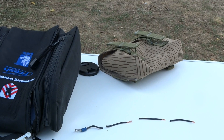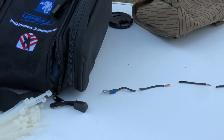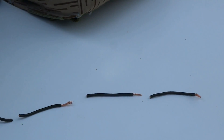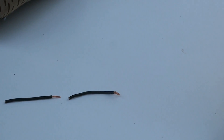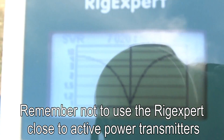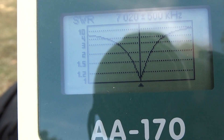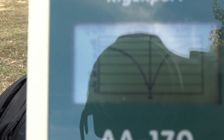Well, I've shortened the wire antenna a bit. As you can see I've done it in a few stages — every time a few centimeters shorter. And we've come up to this now. Let me look at the RigExpert analyzer. Set it to frequency 7.020. I hope it's visible — it looks okay. It nicely dips on the CW band of 40 meters.